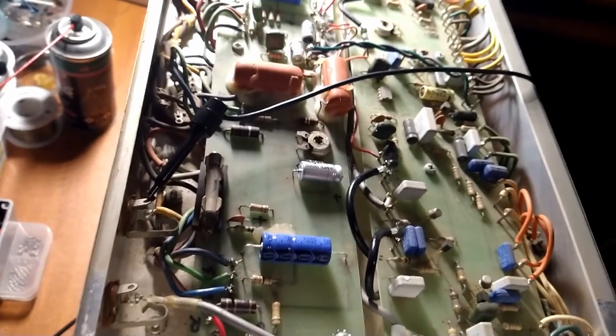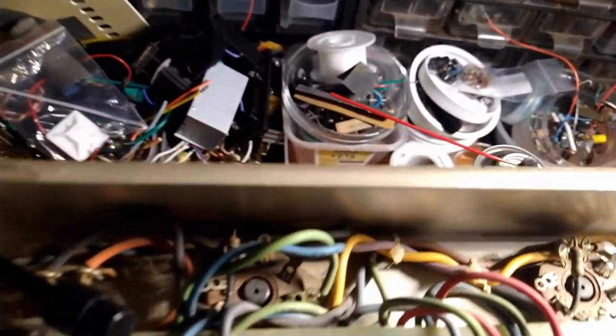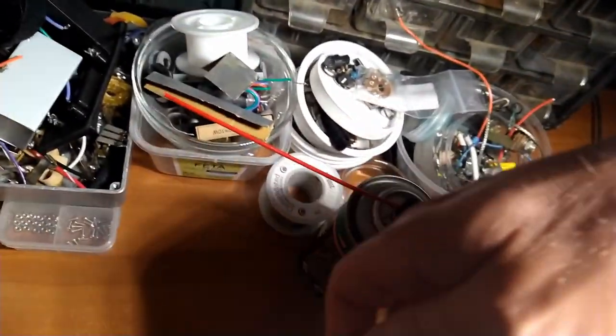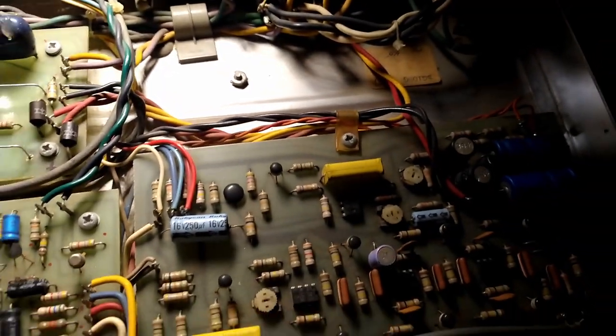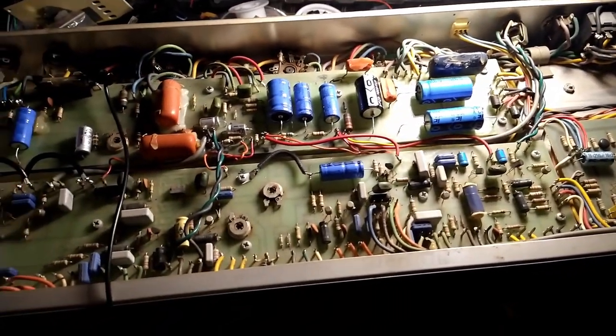Bam. All right, I forgot we got this guy here, the external speaker jack, and we've got the multimeter set up in beep mode. So what I did, just to make sure everything was connected and everything worked the way I thought it would, right now I got the one probe connected to the ground lug on the external speaker, and then we take our RCA for the combo speaker setup, and we have continuity, and it's also the same on the hot tab there. What do you call that? Pin leg, hot to hot, and there is no continuity between hot and ground, or at least there isn't a dead short. So yeah, I'll hook this up to my Univox 2x12 cab, and we'll flip the switch.